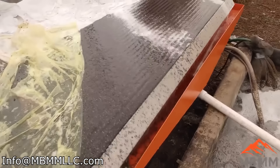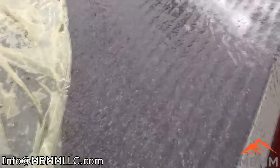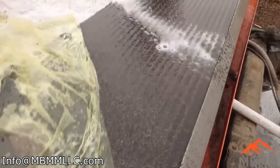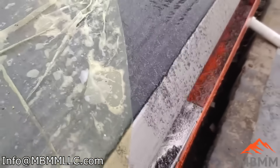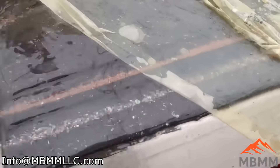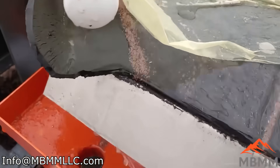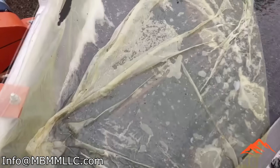This is the screened sample and this one's actually running quite a bit better. I think the particles are a little bit smaller so they can move with the water a little bit better. You can see all the clean plastic coming down here. I have it tuned better as well. There's a little bit of plastic hanging over here, but you can see the copper coming up underneath here into number two, and clean copper coming down here into number one. You can see through this plastic — the copper is just working its way right down underneath the plastic.